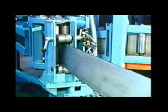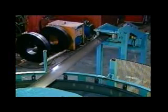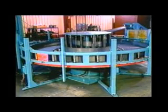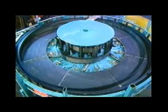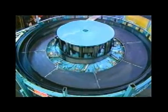The Superloop Accumulator has three modes of operation: fill, mill match, and weld. In the standard fill mode, the pinch rolls on the outside diameter of the accumulator feed the material into the Superloop faster than it is removed by the process line. In the normal fill mode, one wrap at a time is replaced to the outside diameter as one wrap leaves the inside diameter. This OD to ID ratio is approximately 2.5 to 1. The transition point stays stationary on the table in this mode. This process continues until all of the storage that has been removed during welding is replaced.